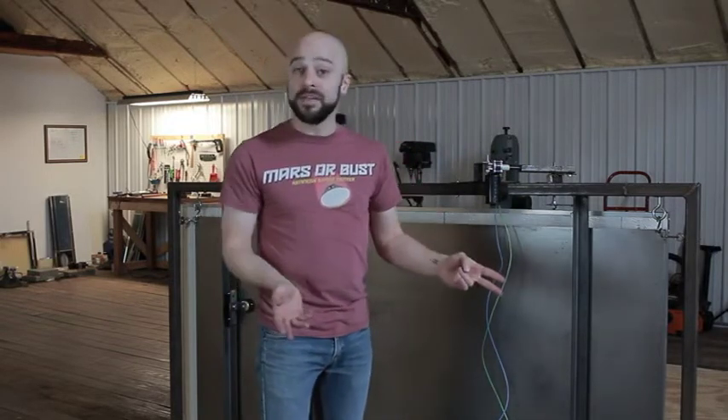Obviously transformers would provide isolation, but that's an added expense and I'm trying to keep the price down. I believe the best solution is to create isolation by splitting up the DC signal so it's not a complete circuit on any given mic channel. Down at the plate there are transformers in the stereo output amplifier, and that's where I can split off the DC from the AC audio signal. We have two different sets of DC 12 volts: one is the power for the motor, and the other is for the information coming from the sensors. So the motor positive would be on pin 2 of one XLR cable, the negative on pin 2 of the other; and pin 3 of each XLR would carry the sensor signals — negative and positive. In theory, in my head, it works — we'll see when I go to try it out.